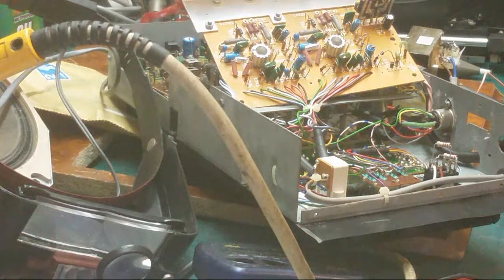It seems to have happened on one channel. All the damage seems to have happened on one channel nearest the rectifier. Is the rectifier okay? Yeah, I've just rebuilt the rectifier board. The transformer's okay. I'm using my own test transformer. Just making sure, you know. But when I tested that transistor, it tested no component detected.